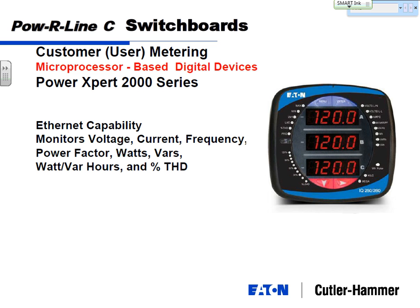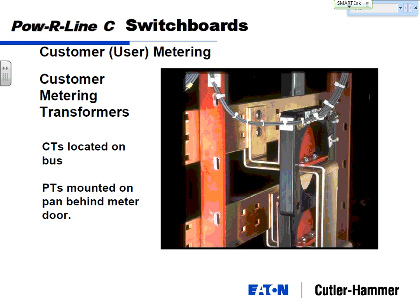electrical equipment rooms now almost all come with some type of Ethernet jack or something in there. I guess my whole thing was you couldn't put it in that panel board and try to figure out how much is coming into this building. Correct. It goes in the meter. Yeah. Right. It's got to go in the meter. Yeah, you have to look at where the CTs are located. So the meter itself is just, I'll call it a display for lack of a better word, or a transducer. The key is where you actually install the CTs. Those right there. That's your metering point.